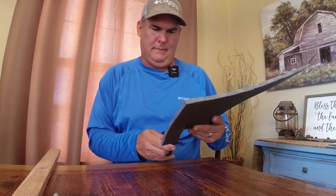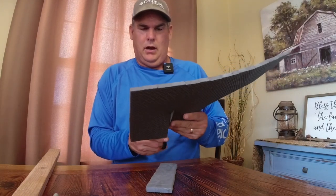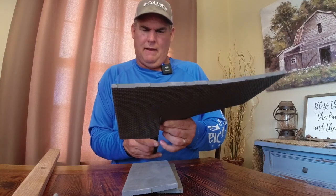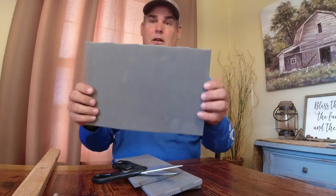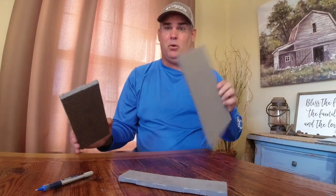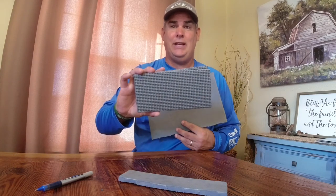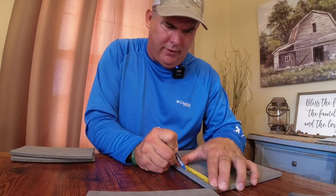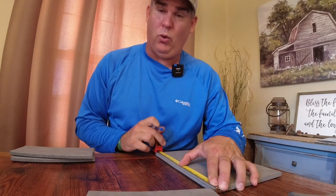Here is my first small leaderboard — this is 4 by 8. I'm cutting my second small leaderboard, also 4 by 8. And what I'm left with is my 12 by 8, one foot by eight inches. Now what we need to do is cut the little slots in there. For the big boards I like to go one inch spacing — so this 12-inch board will have 11 cuts. For smaller boards I like to go every half inch: start with an inch, then split the difference.